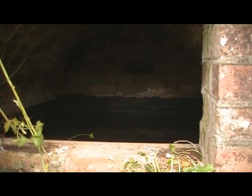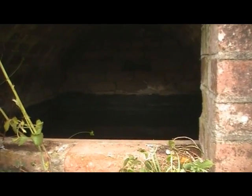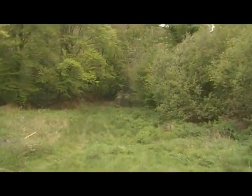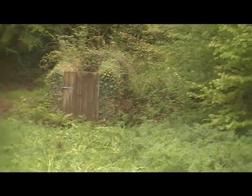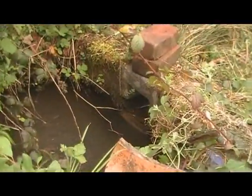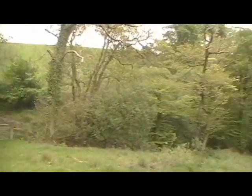At the bottom of this, there are three drive pipes that go down at roughly a four-inch, forty-five degree angle, all the way down in a straight line, straight down there, to where the ram pump house is - eighteen feet underground. What excess water there is that the ram pump doesn't use goes out the overflow just there, follows its track, and down into that river just there.